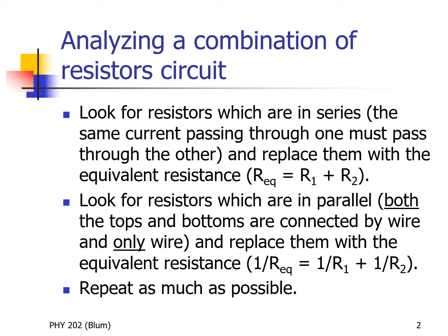Similarly, we will look for resistors that happen to be in parallel, where both ends — the tops and the bottoms — are connected by wire and only wire. Then those resistors will be in parallel and we can use the reciprocal formula: one over R1 plus one over R2 equals one over R equivalent, to find an equivalent resistance and replace the two resistors with one.